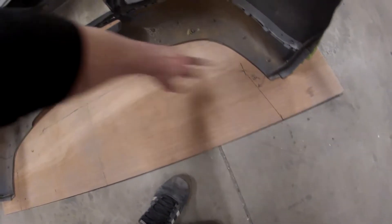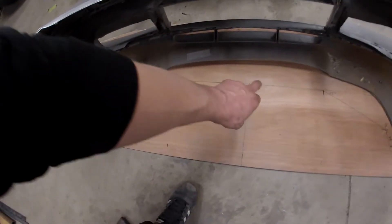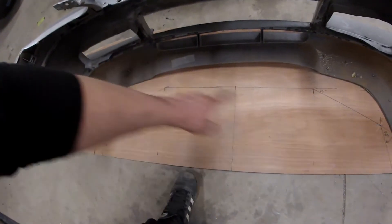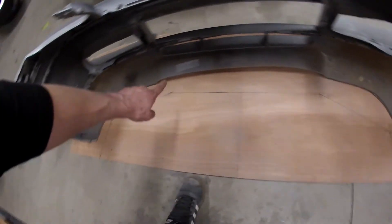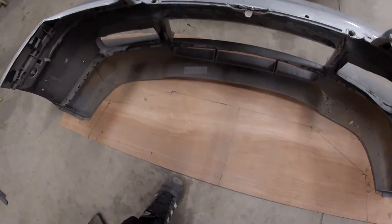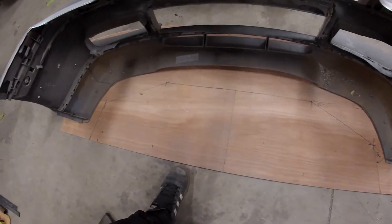That's 48 inches off that first bend piece there, and the same is repeated on the other side. We are going to start with the full bar, measure the middle, measure outwards, mark the points, bend the first one, bend the second one, and work outwards like that. That will assure symmetry and should fit okay.